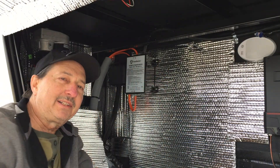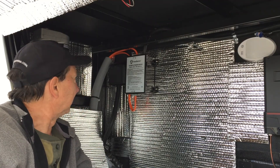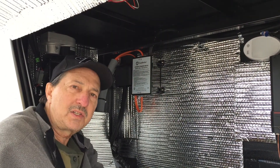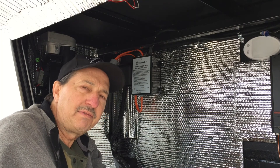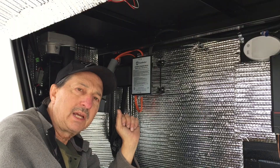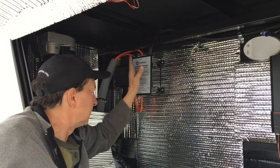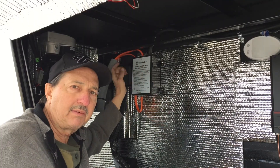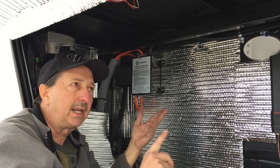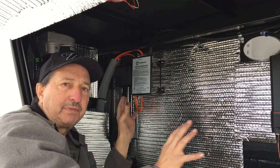I went around throughout the trailer — microwave is on and checked all the outlets. All the outlets are working, so it worked. On a side note, this trailer is a 50 amp system. The main shore power that comes in is 50 amps, but the way it's split out, it's going 30 amps to this box. I've got two 30 amp breakers that will run the microwave, the general circuit, and all the outlets. That just all fits together nicely.